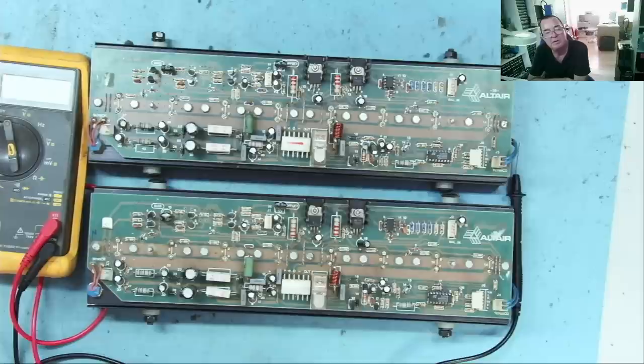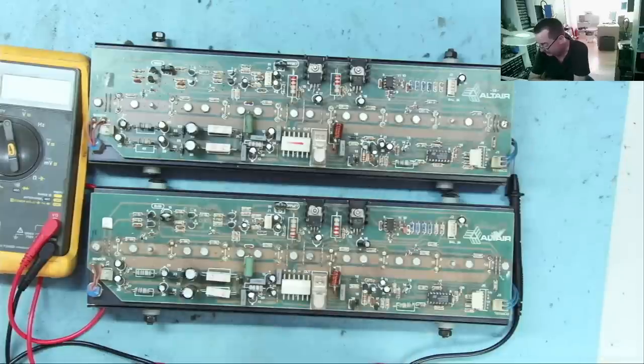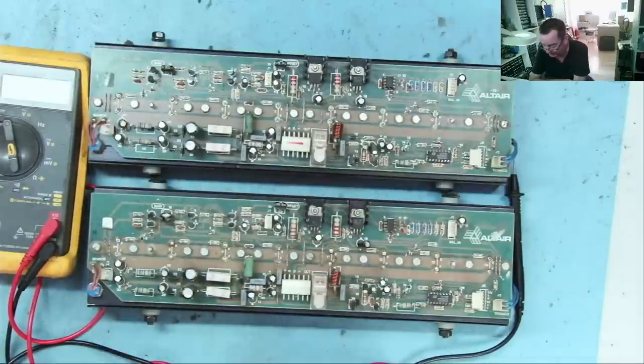Which way do you want to go — how lucky do you feel? I think personally I will just try putting them back in the amplifier swapped over and see what happens. If we still have the problem on the same board, I'll take them back out and swap these chips over, because they're in sockets and they're probably the least easy thing to definitively test. This one is also somewhere in the area of the circuit where the thermal LED error is. So we can swap the chips over and try again.